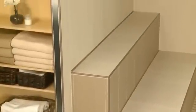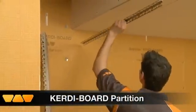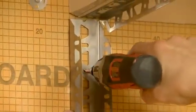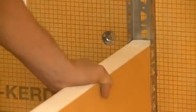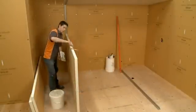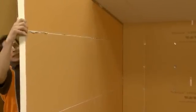Now that we have fastened the KERDIBOARD to the stud walls, we're going to create a partition. The construction of such walls using masonry blocks or stud framing with sheathing is time consuming and requires further preparation before tile can be set. We're going to use KERDIBOARD as a building element and, without any framing, create a partition wall with KERDIBOARD and related accessories. We're fastening the KERDIBOARD ZB and KERDIBOARD ZW profiles to the wall and ceiling to provide lateral stability for the partition wall. The panels of KERDIBOARD are buttered with thinset mortar and placed into the U-shape profile secured to the back wall. The thinset mortar allows adjustment for leveling of the board. We continue this process using thinset mortar between the boards to stabilize the connection. The final board is placed against the ceiling abutting the KERDIBOARD ZW. Open-ended partition walls can be further stabilized and finished with the KERDIBOARD ZA profile.